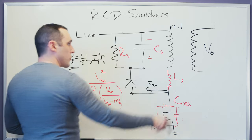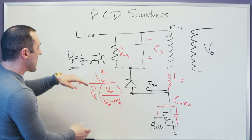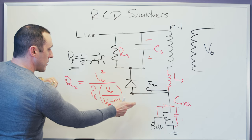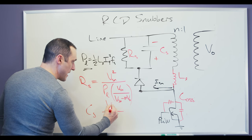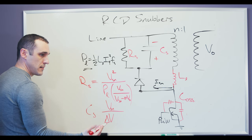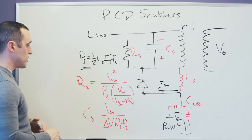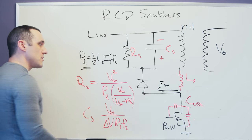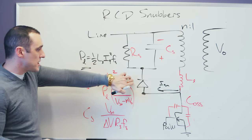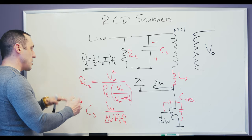We have some output voltage we're trying to reach on the secondary coil, and then this is our value for our snubber voltage that we want to be able to withstand between these two points from the line down to the node connected to the FET. The snubber capacitor C_S is just given by the snubber voltage divided by delta V, multiplied by the snubber resistor and the switching frequency. This basically tells you everything that you need to know about this snubber circuit. The key is knowing how much ripple you can withstand, and what that snubber voltage is going to be — the voltage across these two points that you can withstand with this diode and this FET.